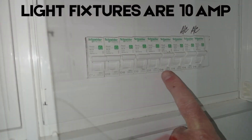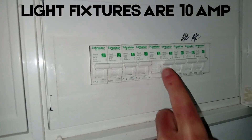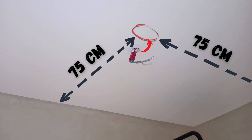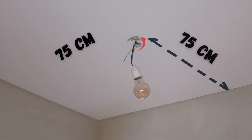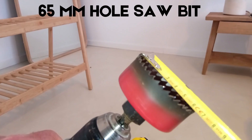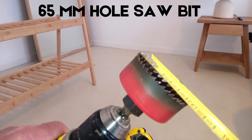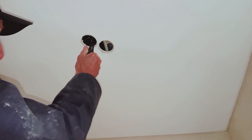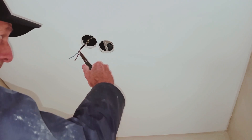Here's my solution. First, I shut off the breaker — fortunately, I guessed the right breaker on this unmarked box on the first try. Make sure to test the wires for current after cutting the breaker. Next, I measured and marked the ceiling for two new holes away from the stud, making sure the two lights are still symmetrically spaced across the ceiling, even if offset from the center. Then I used a 65mm hole saw for drilling the cutout and later fine-tuned it with a couple of small notches with a drywall saw for two spring-loaded clips to meet the 68mm specification in the installation manual. To avoid mishaps, I drilled the hole in reverse and started slow — the drill bit is overkill for drywall anyway, so reverse actually worked smoother. I saved the cutout piece for patching the old holes later, then guided the wires away from the metal stud to the new location using long needle-nose pliers, making sure the wire length was sufficient.